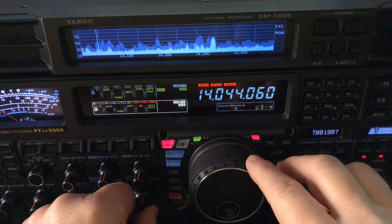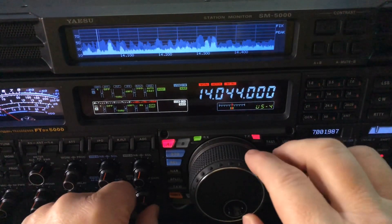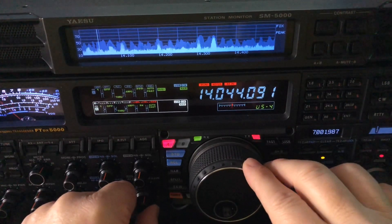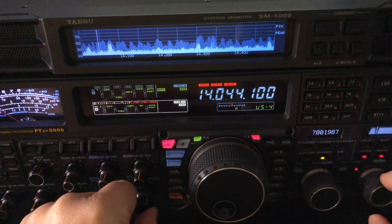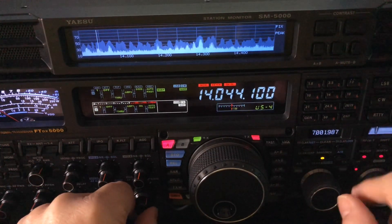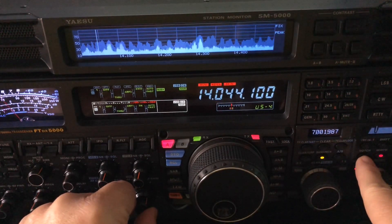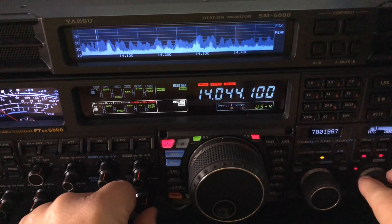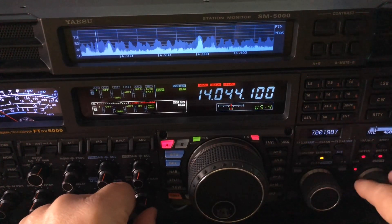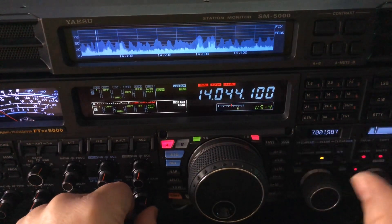He's only 60 hertz away. How do I know that? Let me move down — there he is, centered up. Now I'm going to go 100 hertz away. Let me turn off the manual notch. So here we are 100 hertz away. 520 — 80 hertz below my side tone. You've got to find that sweet spot. I'm using the manual notch filter to notch out a 520 hertz side tone. That's the trick.